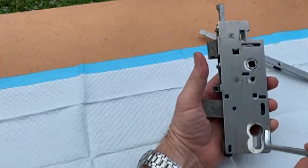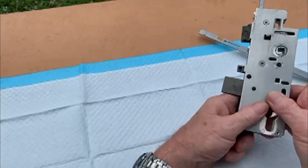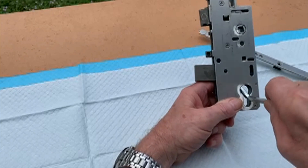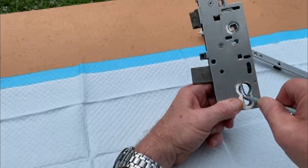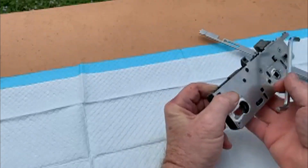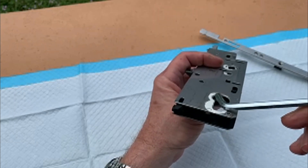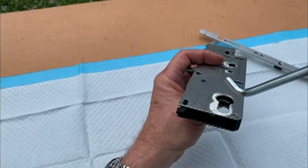It's in the lock position and that release clip is down. I need to hold this deadbolt up because it has to be in line as if the faceplate were still on. You go up and point it toward the hole — you'll feel a spring action when you find it. It's inside there and you push up, get that spring action, then rotate it away and pull the deadbolt in. That little black bar inside there is what you need to push up on — push it up and it releases the lock on the deadbolt, then you draw the deadbolt back.